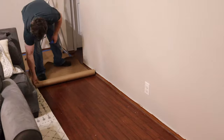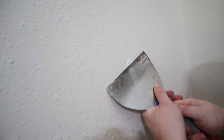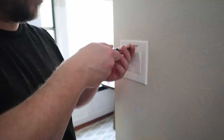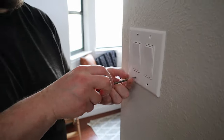We first started off by covering our floors with this paper that we got from Home Depot, just to protect our floors. We then took the spatula and took off any parts of the wall that were especially raised. We then moved on to taking off any air vents and our light switches so that they wouldn't get gunked with joint compound.